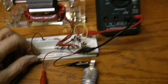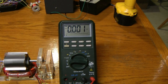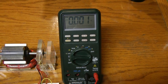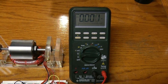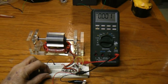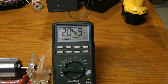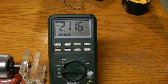Back to the water batteries — I've put a direct short across the rails from plus to minus. You don't have to worry much about the current these batteries have, they're pretty safe. You can see the meter is down to zero volts, but I'm not going to hang around there too long. You can see they recover pretty quickly — the voltage goes back up over two volts, close to where it was. Sometimes they'll even bounce back a little higher.